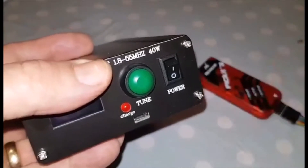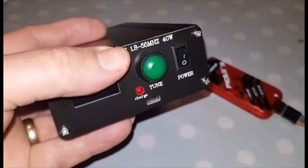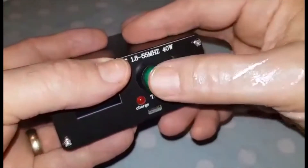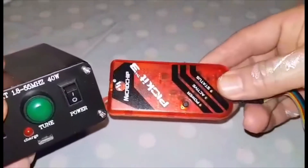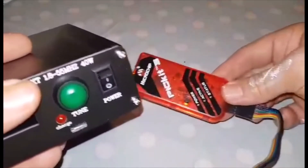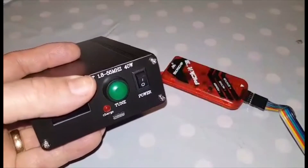Let's convert our AT100 Pro so it kicks in at 1 watt to tune and also tunes without the need for pushing the button. You're going to need a PICkit 3 — get these on Amazon, they're about £20 — to do a bit of programming. We're going to show you how to do that and how to connect this to your AT100.